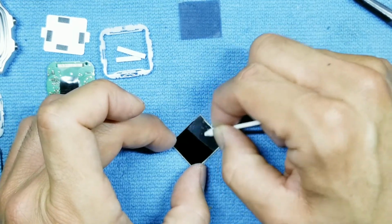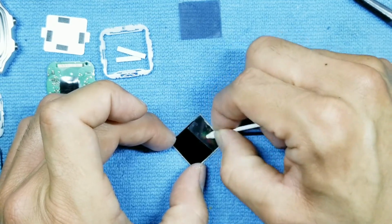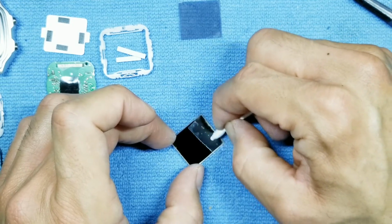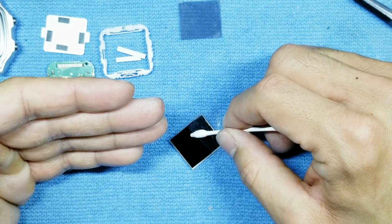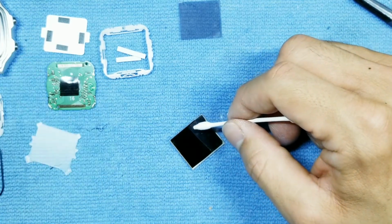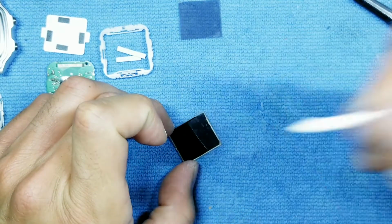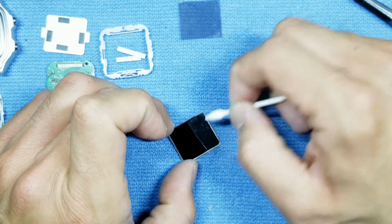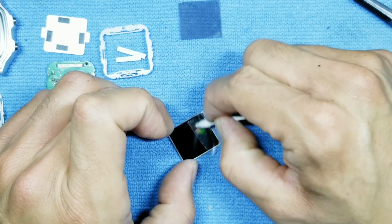Now, if you are using the non-adhesive version of this polarizing film, please comment below how it works out for you. I've been trying to find non-adhesive for a while because it's quite tricky to lay this film down and get it right. A lot of times air bubbles pop up and it's quite hard to remove the air bubble. And what ends up happening is you have to actually remove this polarizing film and cut another one again. Once you stick it onto the display and you peel it off, the glue becomes exposed.